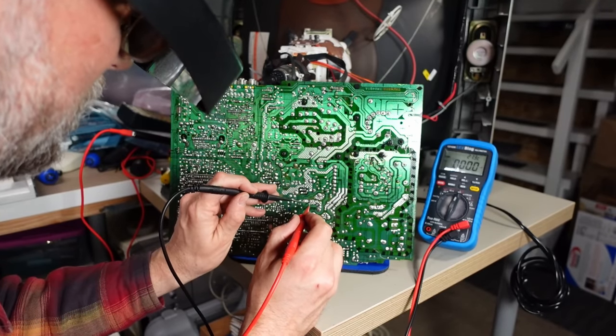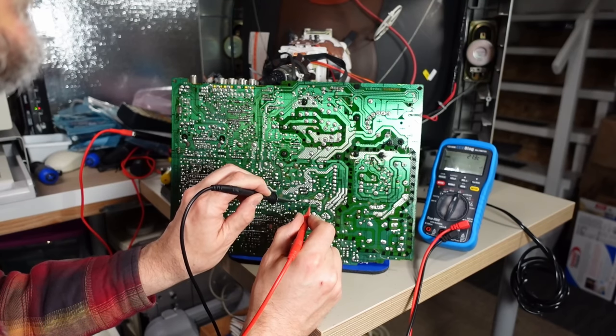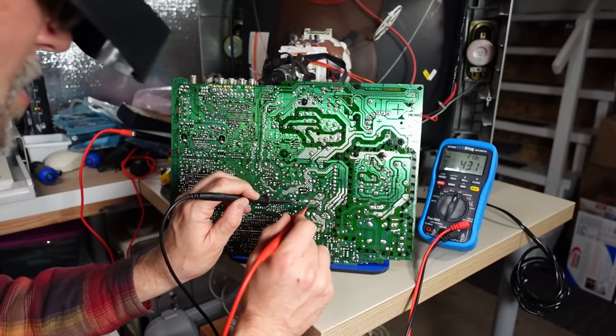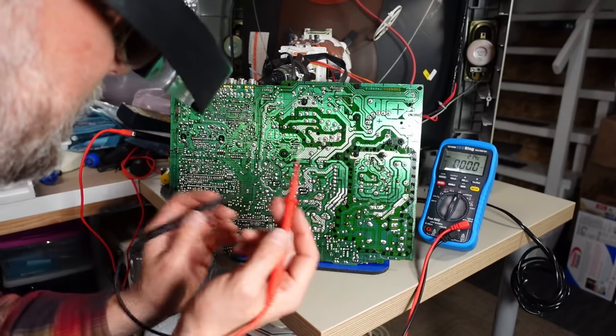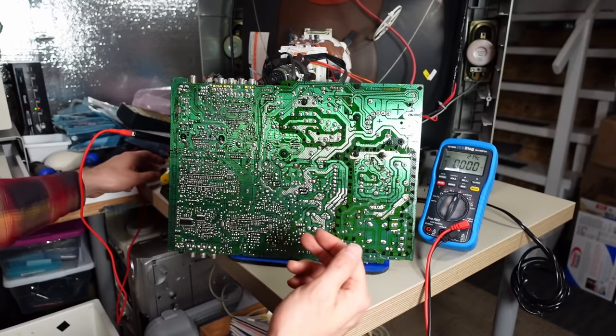And if I read this for capacitance using this meter, see if we get anything out of this. Maybe other caps. 431 microfarad across where there's no cap even installed. So this obviously is in parallel with some other caps somewhere else. Again, the weird thing was, why was I getting picofarads when that cap was in there?